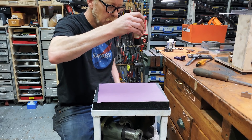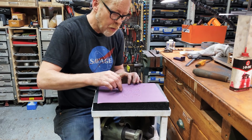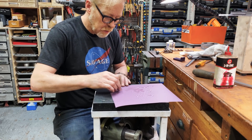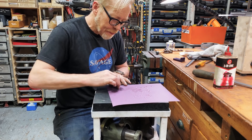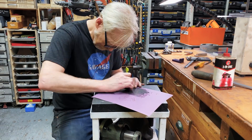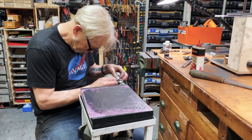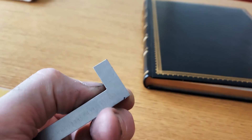This is inspired by Chris at ClickSpring who does a final sand on every part that he makes. I've got some 320 grit sandpaper — this might be 400 — and I put some light oil on it and I'm going to do Chris's very specific technique of sanding in little infinity symbols, little figure eights. You can see my tongue sticking out. On the workbench you can actually see the vise that I'm replacing. I'm getting a really nice little part. There's the L with the slot cut out of the bottom to fit the carrier for the live jaw — I'm really pleased with how that looks.